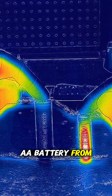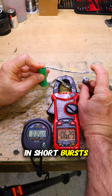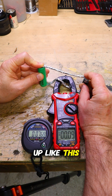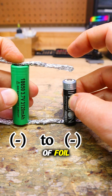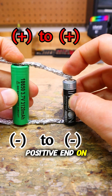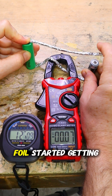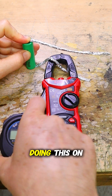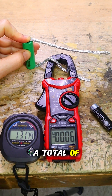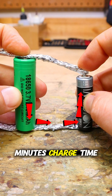To prevent the AA battery from taking on too much heat, I would charge in short bursts, setting the batteries up like this — putting the negative contacts of each battery on one strip of foil and holding the positive end on with my fingers. At any point when the AA battery or the foil started getting warm, I stopped and let it completely cool down.